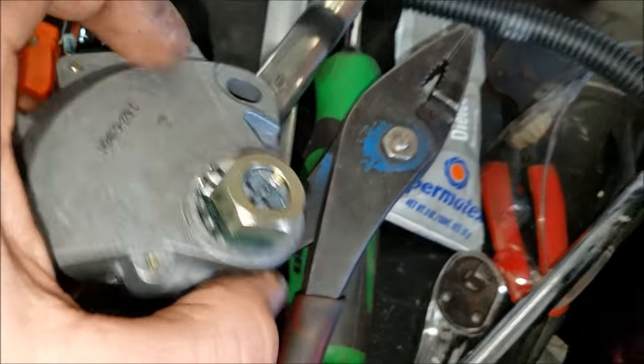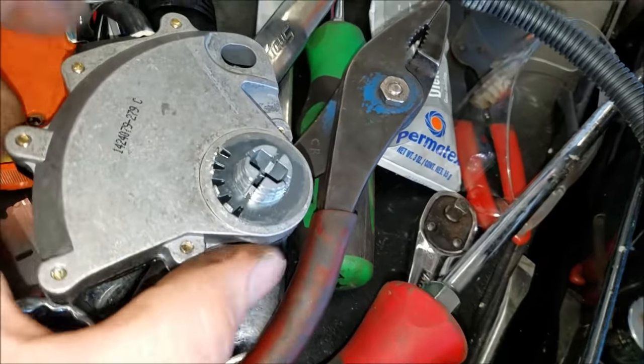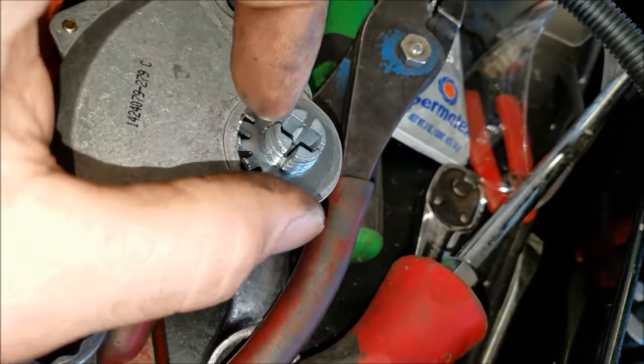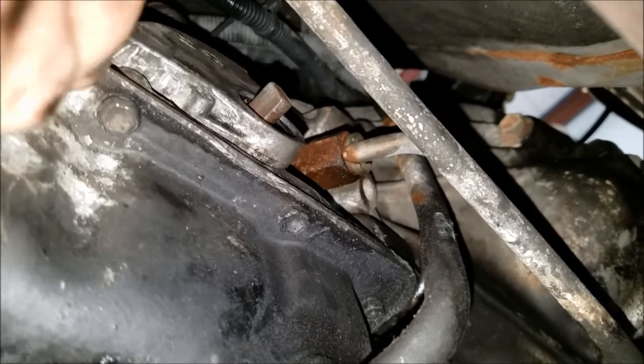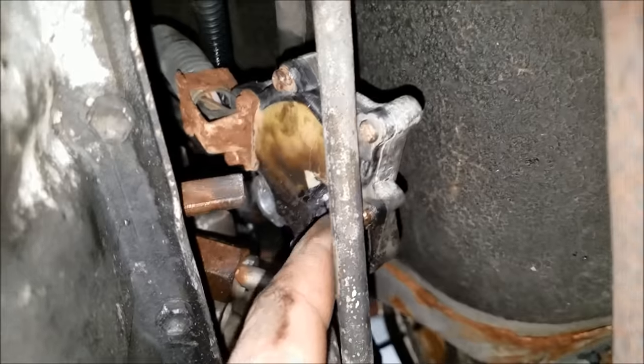The way this thing locks onto the shaft — spin this nut all the way off and then spray a good amount of rust penetrant all over here, because you're going to find that these shafts get very rusted, and that's the biggest bear of getting these off. This one actually broke coming off — it was on there so tight, but there's a technique to doing it. I'll show you that.